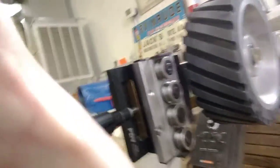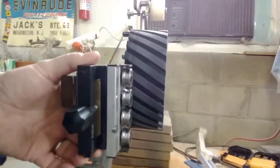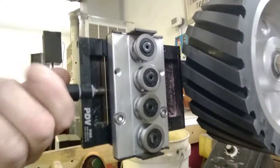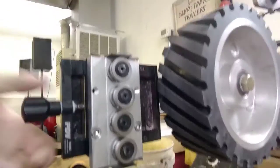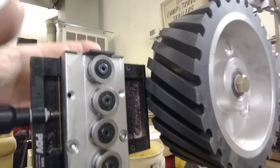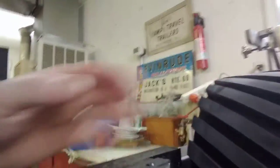The other part is this table here. I don't really know what you call it — some places I've seen it described as an optical table. It's basically a micro-adjustable cross-feed. When you turn this knob, it's going to slide this base piece for the rail closer or farther away from your wheel, which is what allows you to advance your piece into the belt and get an even surface grinding.